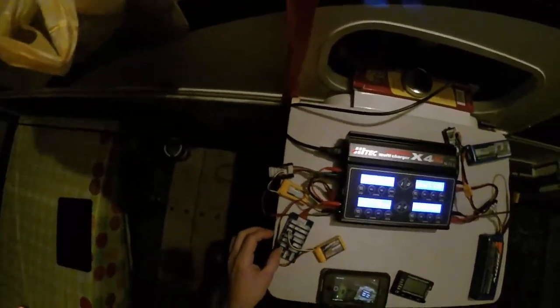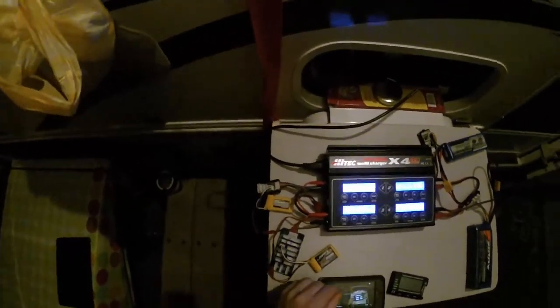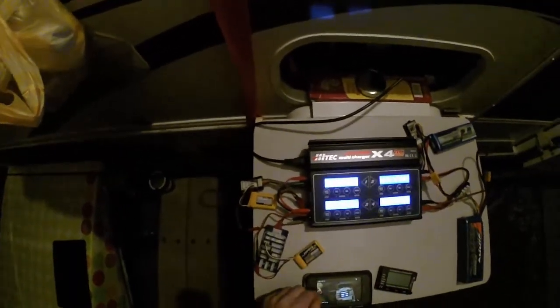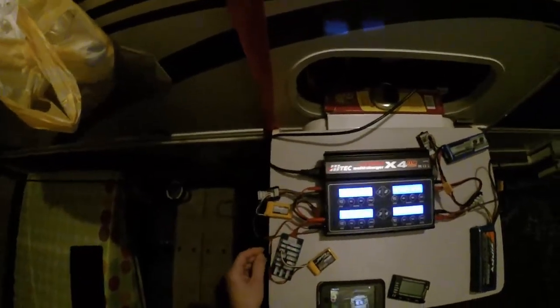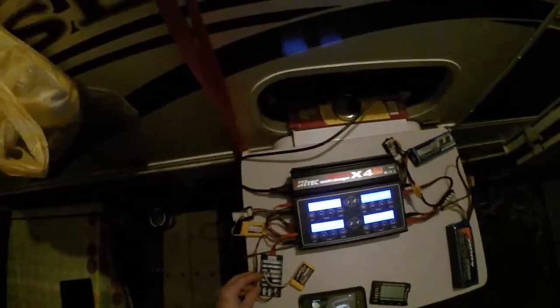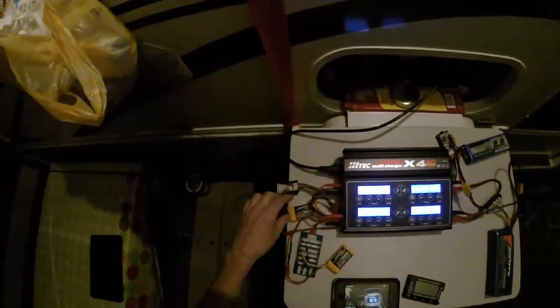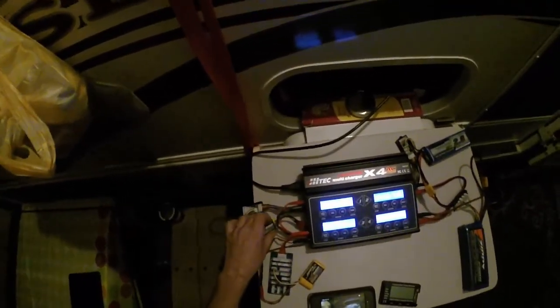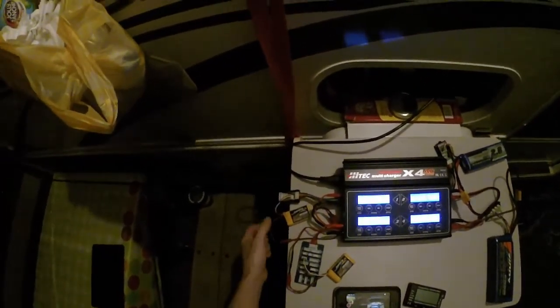You should never leave a LiPo battery unattended when you're charging. If you ever have to store them, give them a storage discharge — this battery charger will do it. Most four-button battery chargers are the same. You have to charge them attended; try to lay them in the middle of a concrete floor away from anything flammable — outside in your driveway, in the middle of your garage on a concrete floor, away from your cars and any flammable stuff. These batteries can explode, and it isn't good when they do. A buddy of mine lost his garage over it — they do burst into flames sometimes at unexpected times. If they get puffy, it's not worth your house for a puffy battery; it's 20 bucks. Throw them out when they get puffy, or if they're still under warranty, send them back. Thanks for watching.